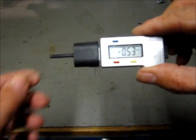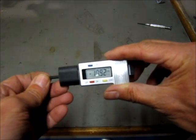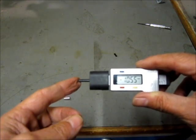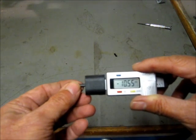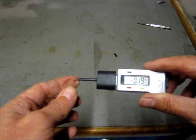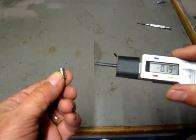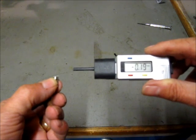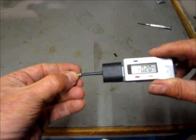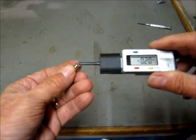Okay, so it's back together now and still working. What we need to do now is find some way of coupling this probe to the cross slide of the lathe. It'll obviously move in one direction, but we need some way of coupling it so it can be pulled in this direction. One solution would be to spring load it, but what I want to try and do is use one of these tiny neodymium magnets to couple the end of the probe to the moving part of the cross slide. To do that I need to turn up some sort of adapter to fit this 3mm shaft to this 6mm magnet.